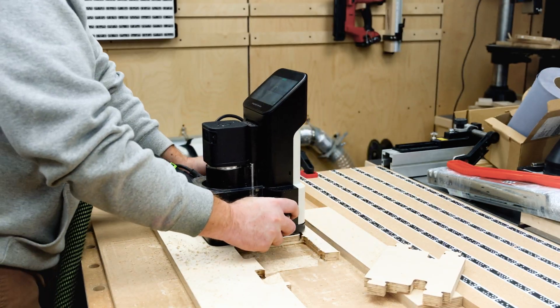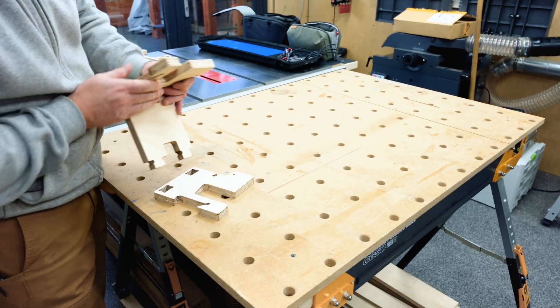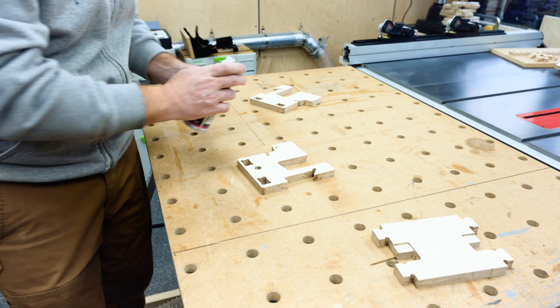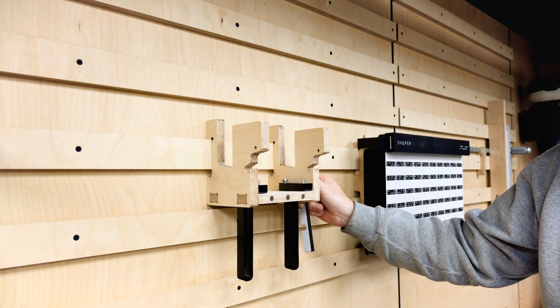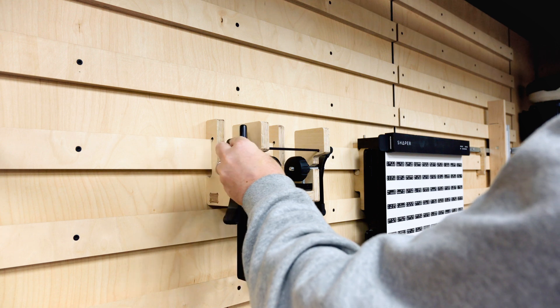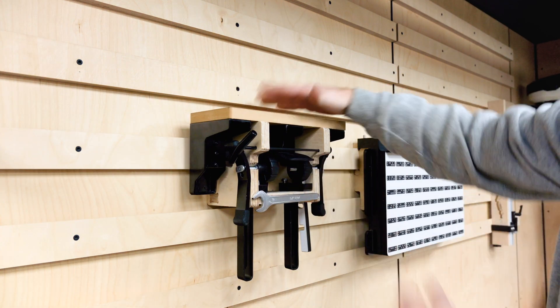You can lastly do the outside cuts. With the three parts ready, you can push-fit them together — no glue or any other fixing method is needed. We do however need some CA glue to fix our magnets and the M8 nut. Now we're ready to hang the assembly and fit our parts, where we've got space for the support arm brackets, the angle bracket using the M8 nut, the front plate clamps, the long hex wrench, the collet wrench, and of course the shelf, which also gives us a usable shelf up on the cleat wall.